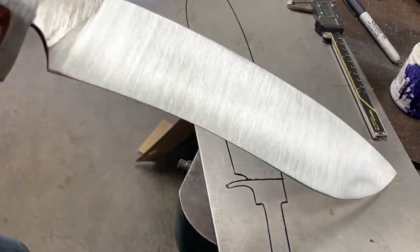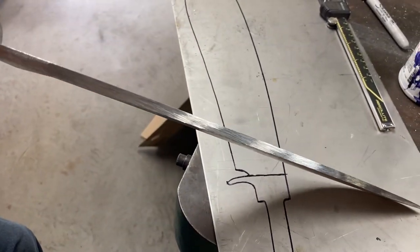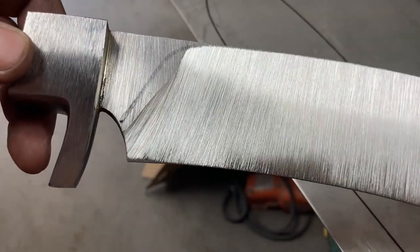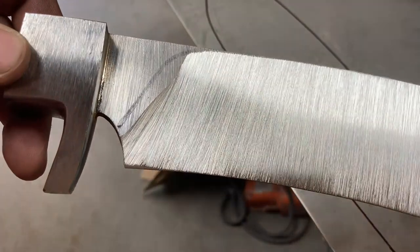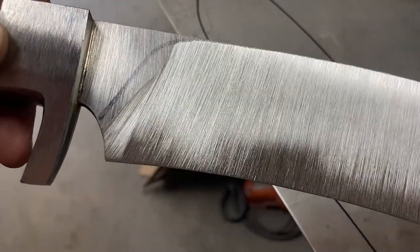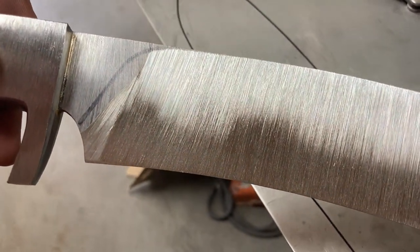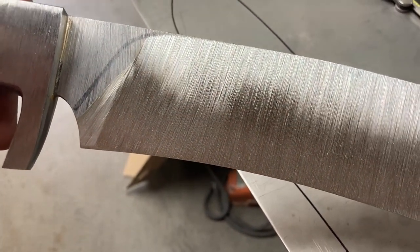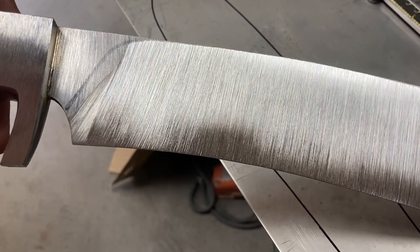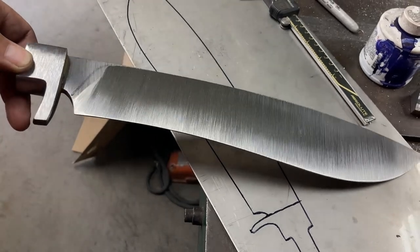We got a nice flat clean recurve bevel all the way up the one side. And you can see that right now this is pretty much of a hack job, but importantly it's a hack job inside the line. I was just carving away at it getting the material out in a timely fashion, but I stayed inside what would become the plunge cut and that's the important part. So once I get the other side up to this far we'll actually take a look at how to control the plunges to be the shape that you planned them to be.